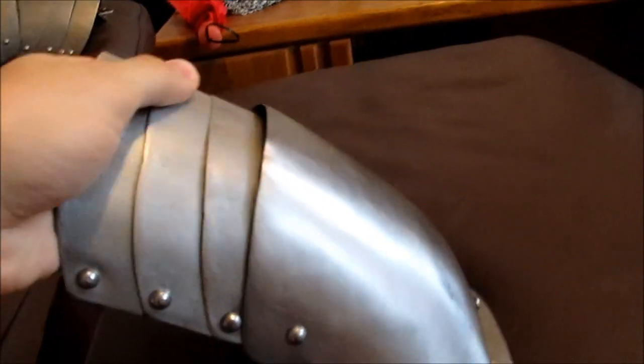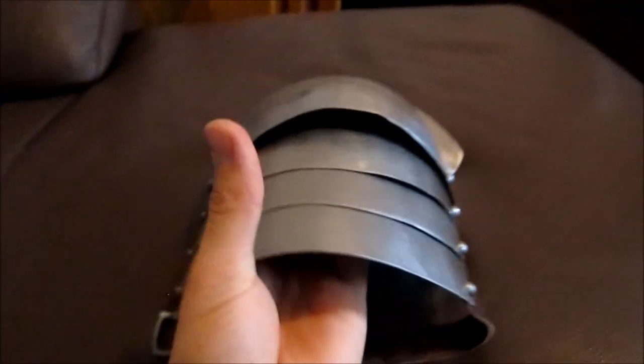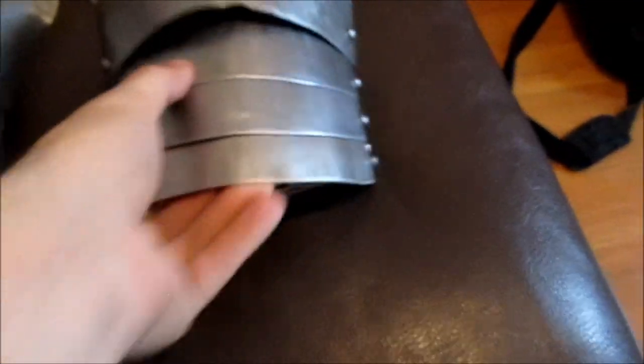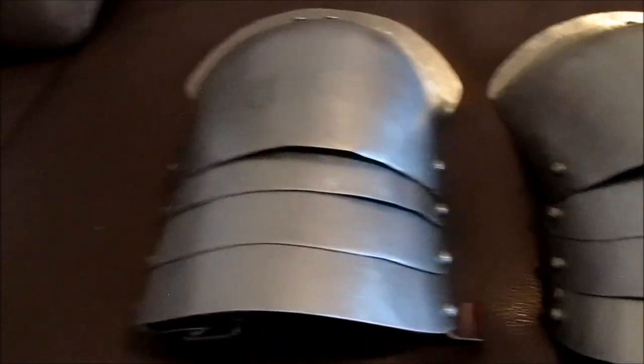It's not going to be the same as actual historical armor, which is around 16-gauge steel. I chose 22-gauge because everything I'm making is handmade — sheet metal bought from a sheet metal supplier, leather from a leather supplier, and even the belt buckles are just steel rods bent into shape. 22-gauge mild steel is a lot easier to work with than 16-gauge, and for my first suit of armor I wanted something more forgiving for the mistakes I'd inevitably make.